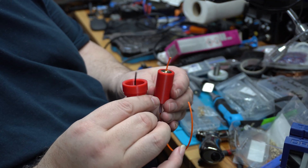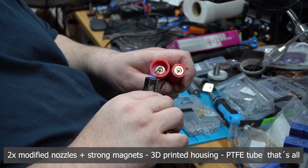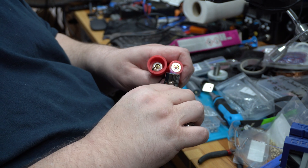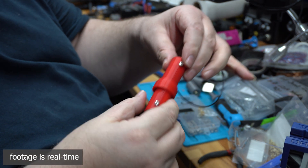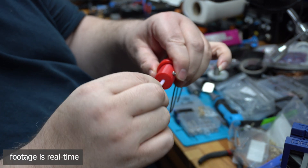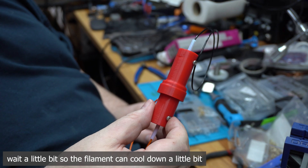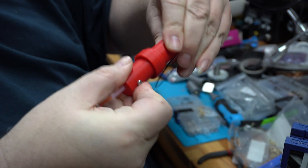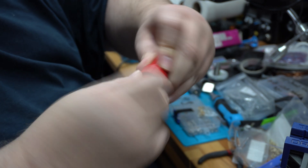So as you can see, both filament ends are fed in, and now you see all the magic. You heat them up with a lighter — you can also use a hot air gun, but I wanted to show it works with just a lighter. Both ends are burned, which really helps. Then you simply put them together. There are two strong neodymium magnets on both sides. They are not glued in on my example — it's a prototype, fresh out of the printer.